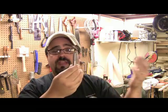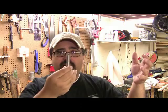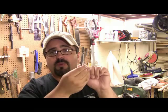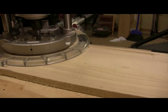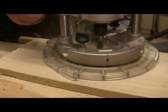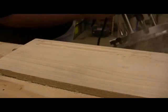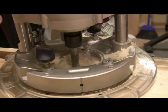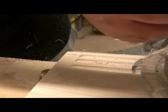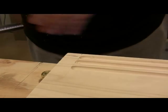I've got a setup and we're just going to make a couple of pieces. Depending on how wide or how narrow we want that piece, we can make the grooves wider apart or narrower apart. I've already made my first pass with the first flute, and now we're doing the second one. When doing this, you need a starting point and a stopping point — you want to remove the material in between the two, so it's best to have a stop block. Now making the third pass, we plunge the router down and begin to make the pass. It's important to stay between our ending and beginning marks so the flutes look uniform, and to watch the spacing.